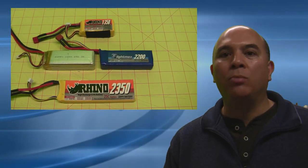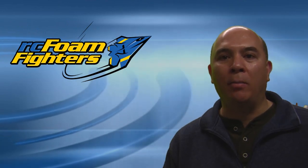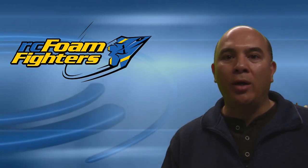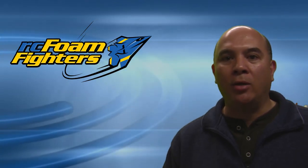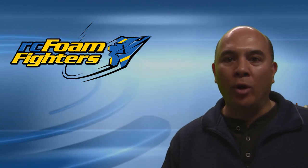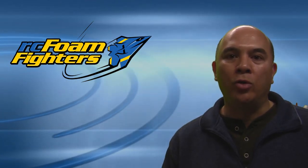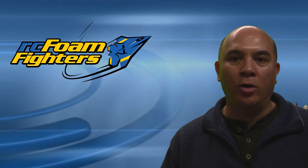Step three is choosing the correct LiPo battery for this system, and this is probably the most important one — because if you don't get the right battery, you have a very high chance of puffing it or burning it up. Normally what you want to do is look at the max constant amp draw capacity of the battery. It should be rated at least one and a half times the maximum amp draw of the motor. So say you have that 28 amp max draw motor — you're going to want to go one and a half times that, which would be around 40 to 42 amps. Your LiPo battery has to have at least a rating of 40 to 42 max constant amp draw in order to handle that motor without puffing or burning up.